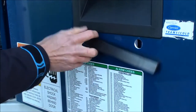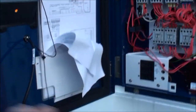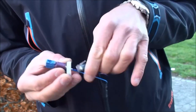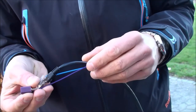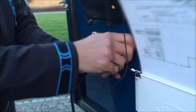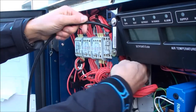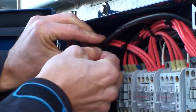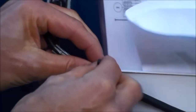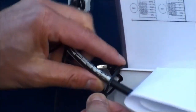The antenna cable must be guided through the left hole. Mount the antenna using the supplied PG-11 nuts, which you must tighten firmly with a recommended torque of 2.5 Nm. Open the door completely and guide the cable from the antenna to the RMM Plus device. Use cable binders to keep the antenna cable in place.